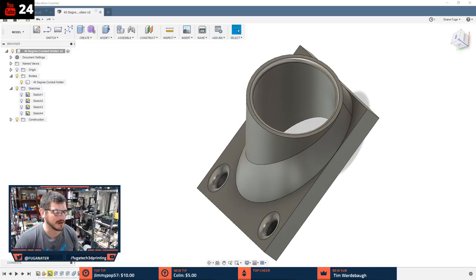Yeah, especially if you bought it from somewhere like Amazon or something, they should absolutely take it back without a problem. Ever have the heater cartridge short out on a hot end while cleaning the filament that jammed around the nozzle? No, I have had some pretty gnarly clog that I had. Well, not a clog, but I got that great big glob all over the hot end. And after heating it up, nothing should short it out unless you hold the two ends together.